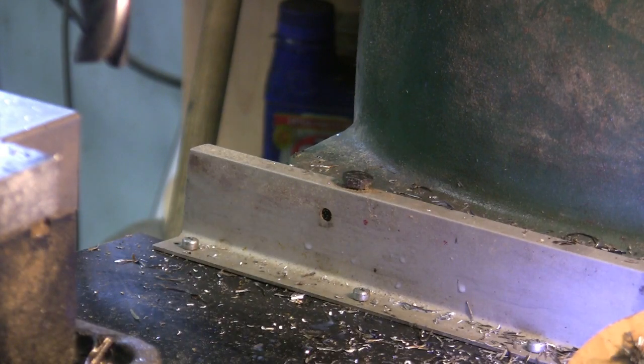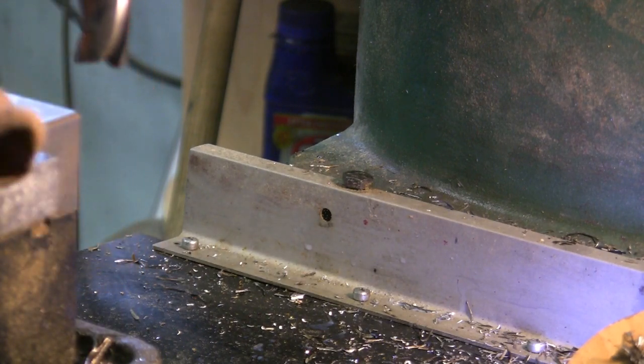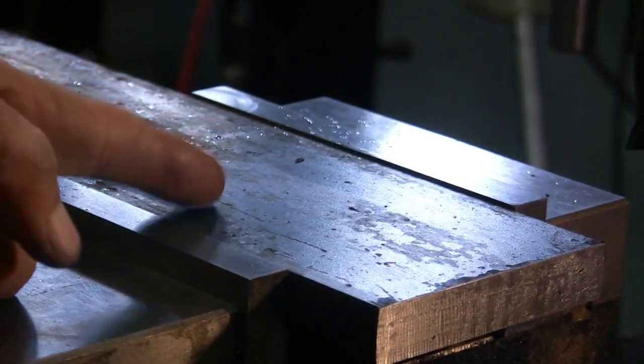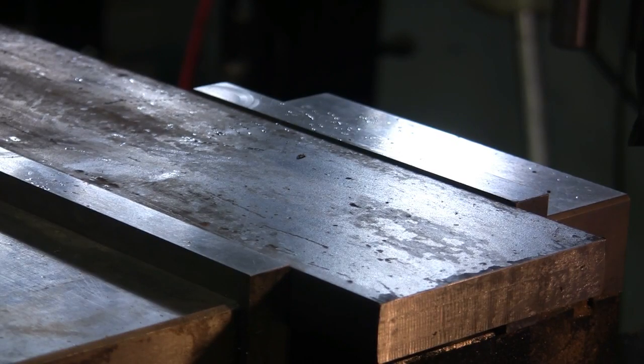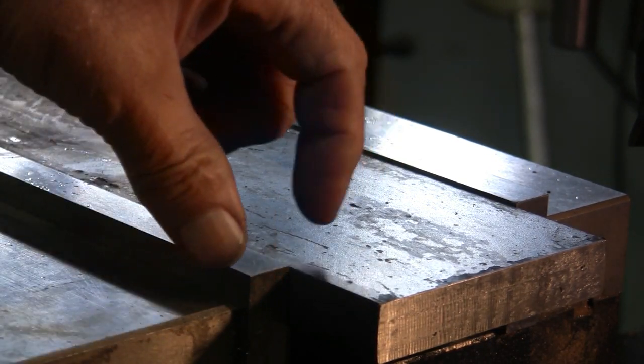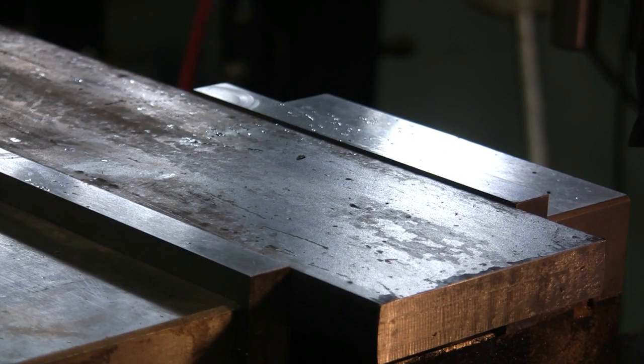All right. So I'm going to go ahead and set the bandsaw up, and I'm going to cut 4-inch pieces, so it'll be 4 down the line. And I'll be back when I get all the pieces cut, because then I'm going to measure to the center and put a 1/4 inch hole through the center, and that'll be my index hole for the fly. This is for the flywheels, by the way. I don't know if I mentioned that or not. So I'll be back.